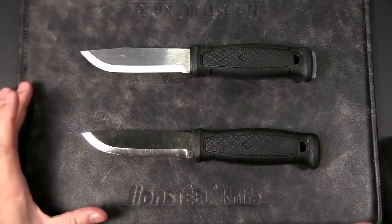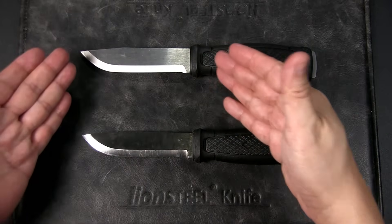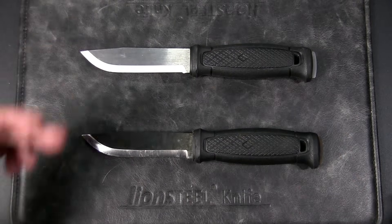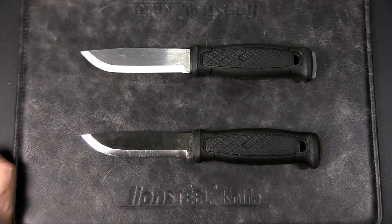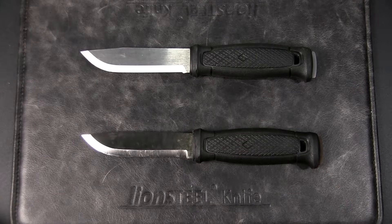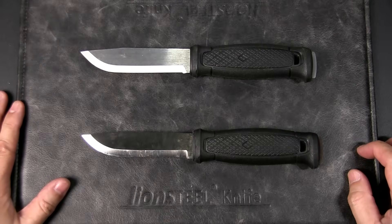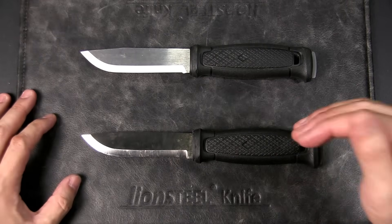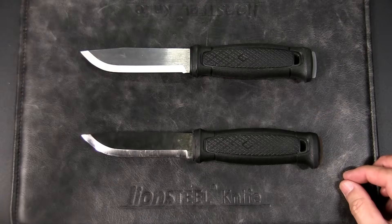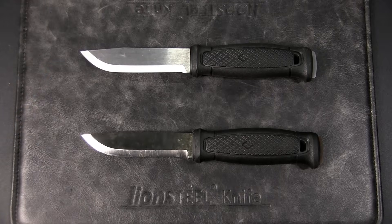Additionally, 14C28N has a finer grain structure, which contributes to its increased resistance to fracture. Overall, 14C28N is also a more well-rounded steel — it's harder than the carbon steel, meaning its edge retention is better, though the carbon steel is easier to sharpen. But all-rounded, the stainless is both tougher and harder. This is not to say 1095 is no good — it's a very practical and popular steel with knife makers, mainly due to cost.